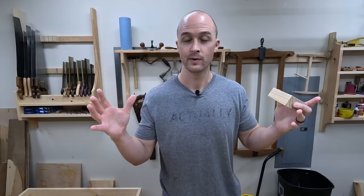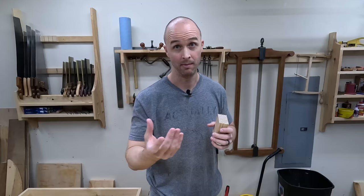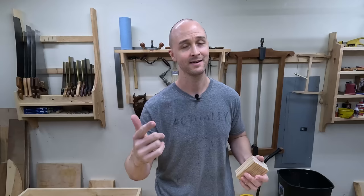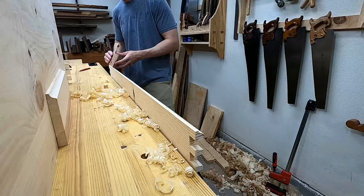As a side benefit, when you're scooting this around, there's no pressure on the trim. Another option — or in combination with these glue blocks — is strips of wood on the bottom of the chest that it sits down onto the ground on. But in either case, the trim should be elevated; it's along for the ride, but it's not holding the chest up. This is a one-man show, so I appreciate any support — likes, comments, subscribes — and if you really want to go above and beyond, I just launched a Patreon page. All the coves I cut with this simple molding plane — if you want to see how to make it, check out that video next.